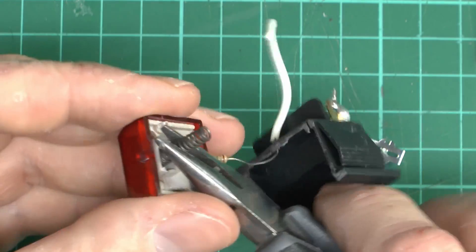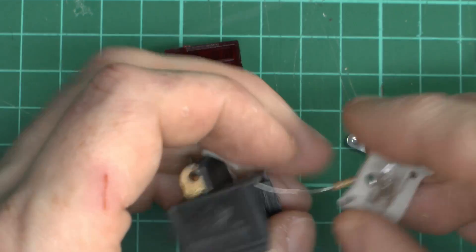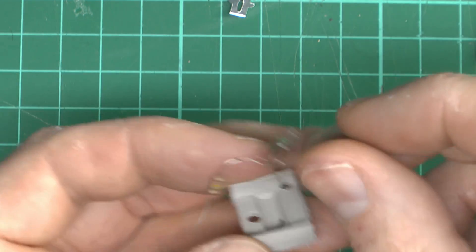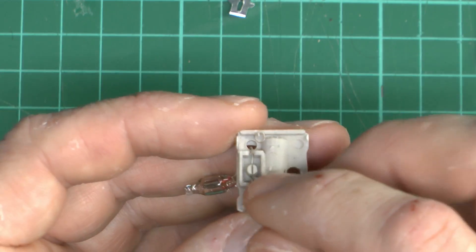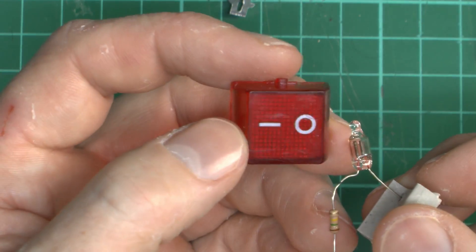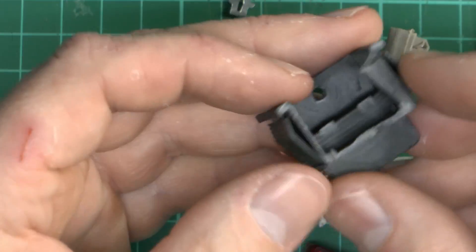So here we have a little resistor and a spring — let's tweak that out and see what we've got in the top. The indicator in this case is apparently a neon lamp — just a little bulb thing. So it's a neon bulb with two electrodes inside, a small amount of neon gas, a resistor to limit the current, and that's the wire that went outside to the neutral connection. The line is actually coming across here, and that's where the spring fitted, so it would simply connect onto the thing when the switch was in the on position. So that's going to glow a dullish orange, and then be even duller after it's gone through the red plastic lens. In terms of quality, the red plastic lens is probably the best quality part of the entire thing — the rest of it being a complete pile of junk.